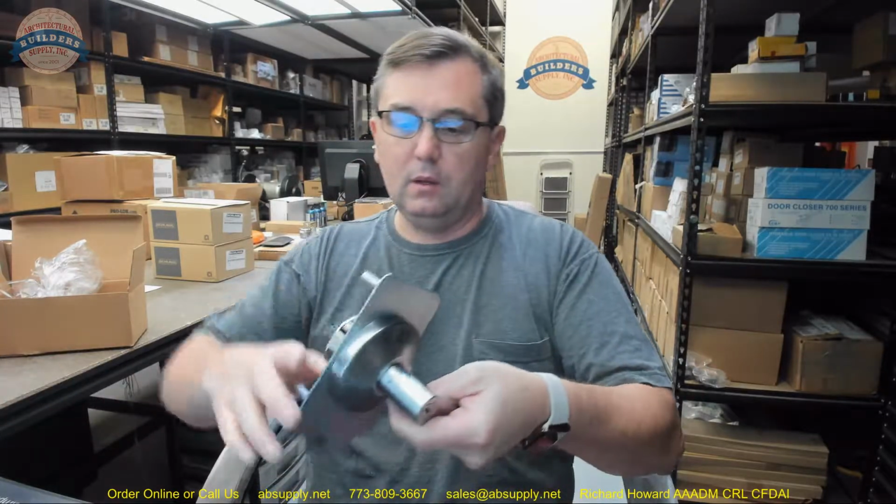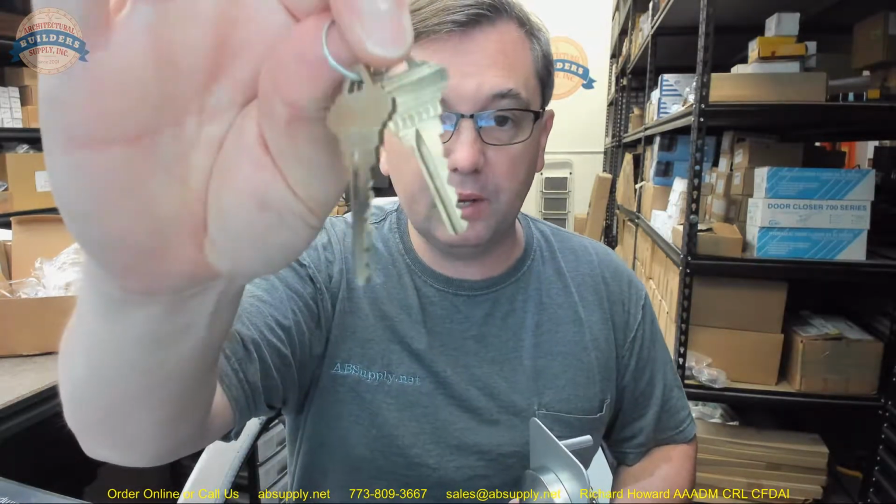Okay. This is the trim itself. This trim is a classroom trim, meaning that via the key, and you do get two original Schlage keys, Schlage being a sister company of Falcon, of course. It's a 6-pin classic C keyway, drilled 6, pinned 6, two original keys, and they're ordered from the factory handed. They are ordered from the factory as their function.